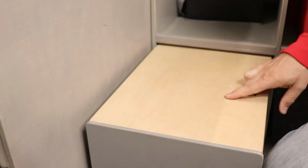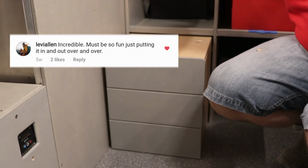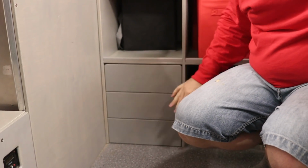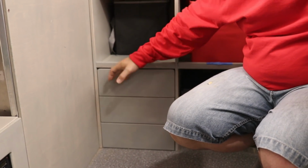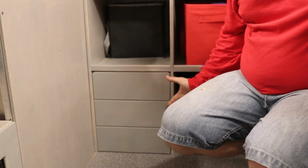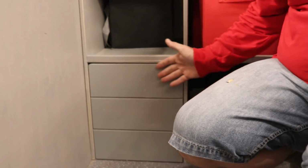And the really neat thing about that being actuated on an air cylinder is that when we're not using it, it's stored out of the way. But because there's no handles and you can't get in behind it, and there's 100 pounds of air pressure pushing that cylinder in, we inadvertently built a little lockbox to keep our camera gear a little bit more secure.